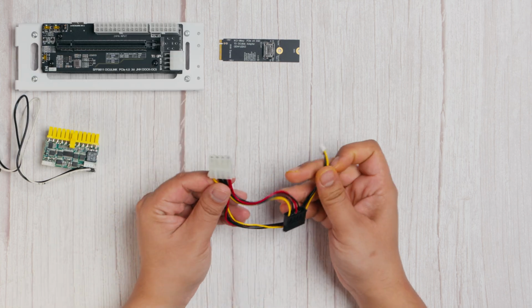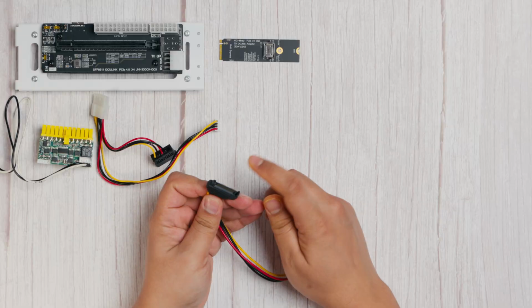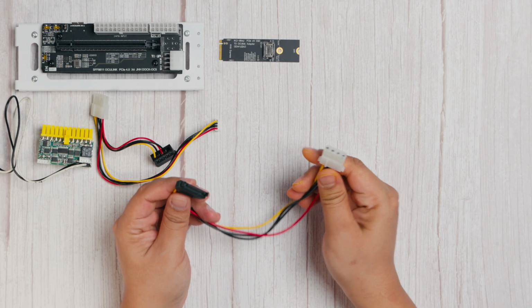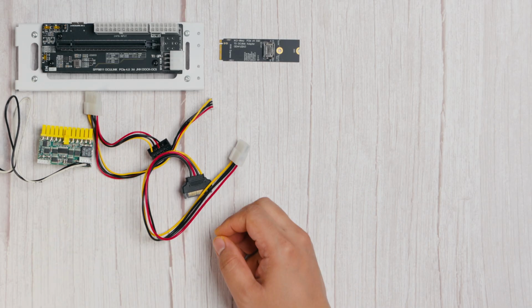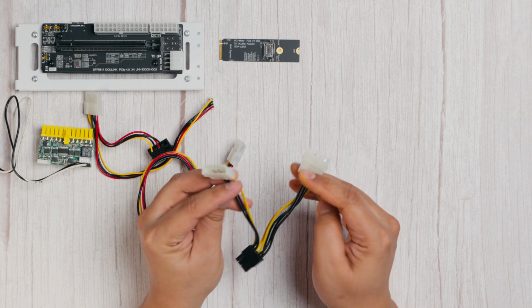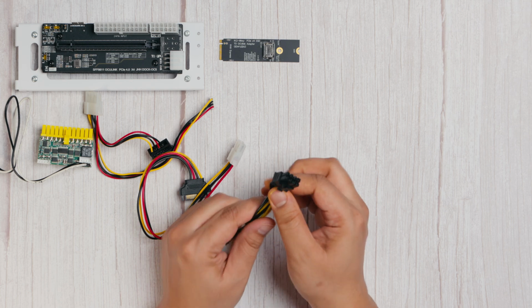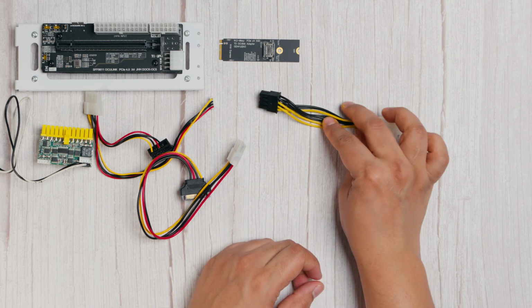To extract the necessary 12V PCIe power from the PSU, we will use SATA and Molex adapters, which will be then merged using a cable to provide the PCIe power required for our GPU. Please note that I decided to use Molex mergers as it's a bit more secure than SATA. If your PSU has a dedicated PCIe output, you should use that instead.